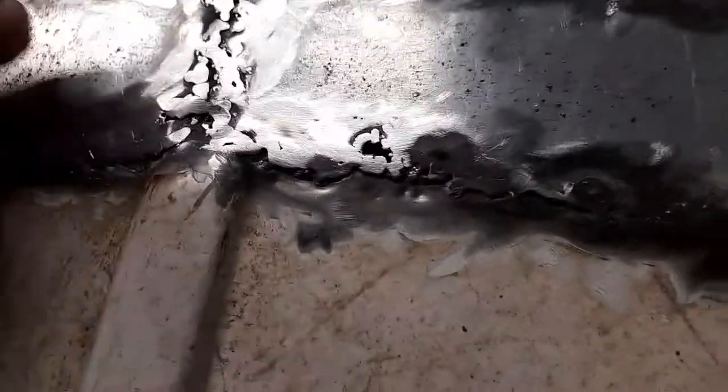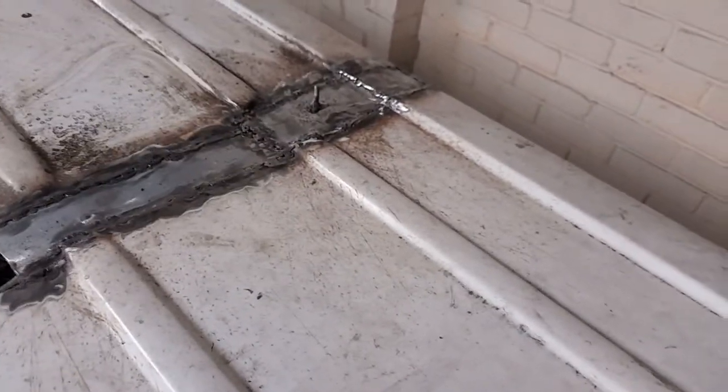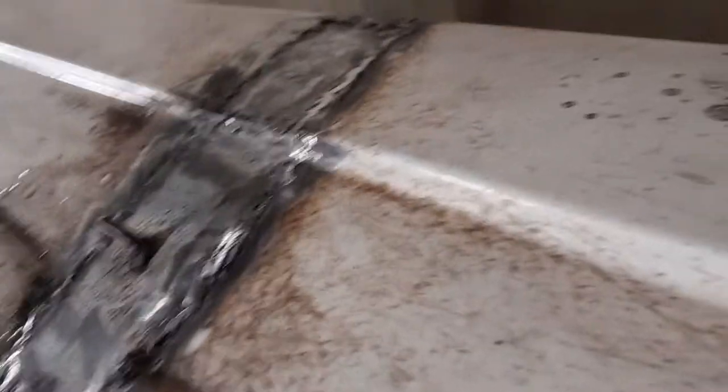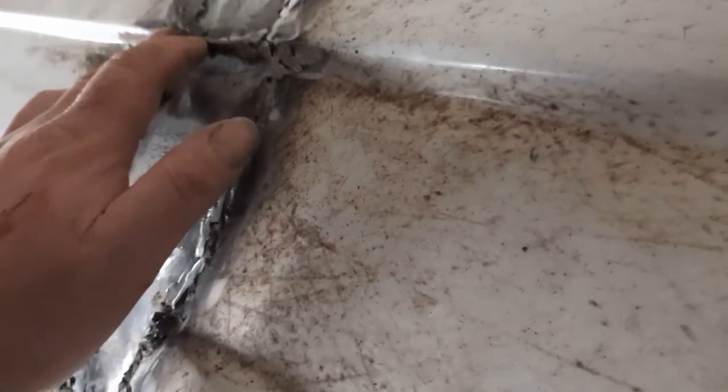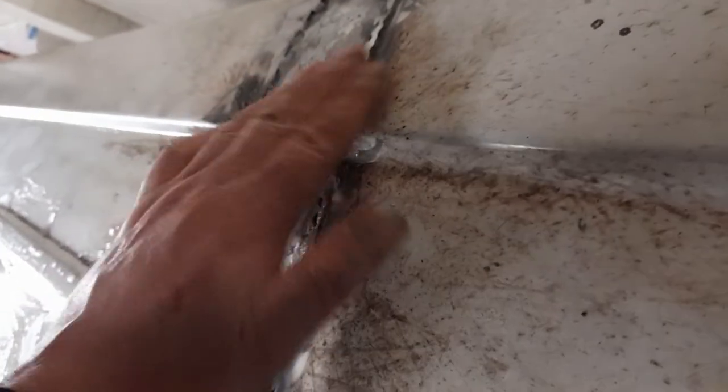By the time they're all ground down, if I go around the other side of the van I'll be able to see how much penetration I've got, and if necessary we'll do a second seam. So the repair on the roof - the metalwork is done and I'm quite chuffed about that. It looks like a dog's dinner but all I'm interested in is the bits that you can see from the ground - that's got to be lower than the surrounding metal.